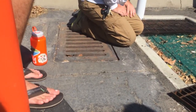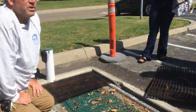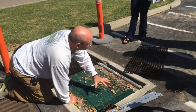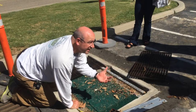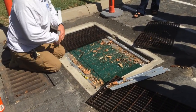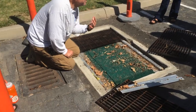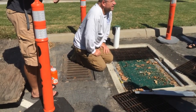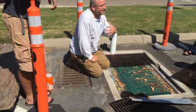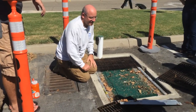Because this is our demonstration area — this is a test. We don't want to screw up campus; we don't want to have a massive problem. So this is designed to get a decent amount of flow, but if it's crazy, crazy flow — and if we have our El Niño rains like we're thinking we might — it can bypass here and go in here. So we won't flood the parking lot. Because we haven't tested this exact design in this particular site, and especially because it's an El Niño year, we don't want to cause a hazard. When we're evaluating and developing technology, we don't want people to say the thing caused a horrible flood of the cars — that would be bad.